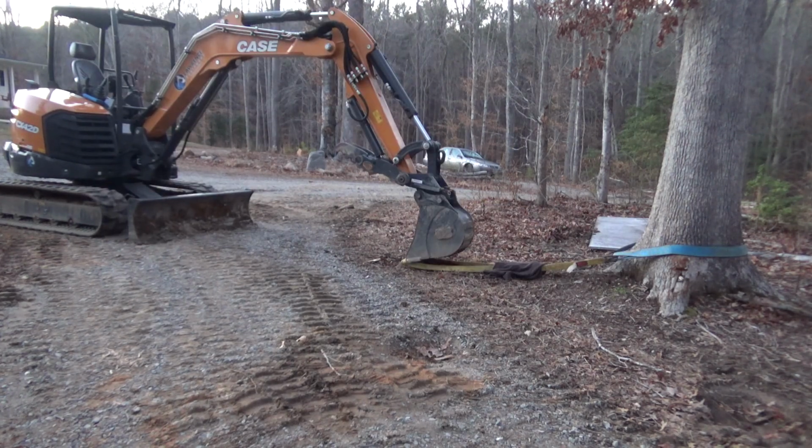Got 7450 on the end of the bucket, so that's worst case scenario. Those teeth can pull 7450, and as you saw, there was no way I was doing that without putting that blade down. That machine wanted to pull itself over. So anyway, we'll try the Yanmar now. I'll drop this bucket with the coupler and connect it with the Yanmar.